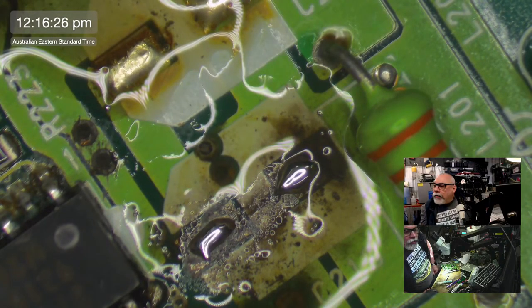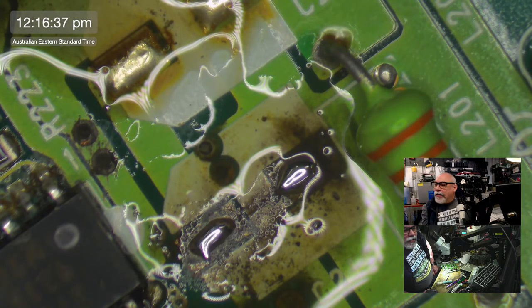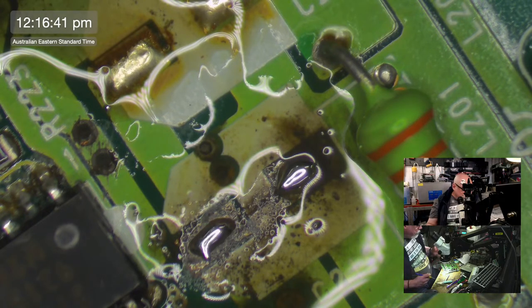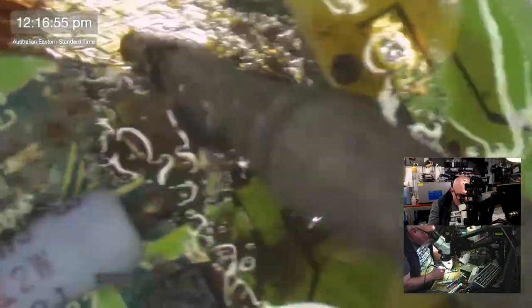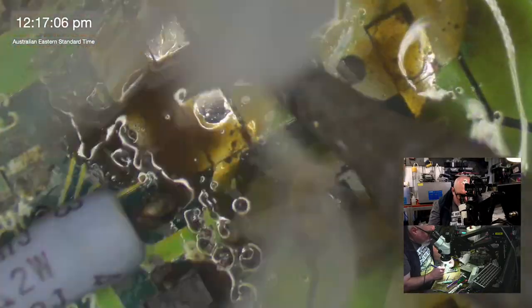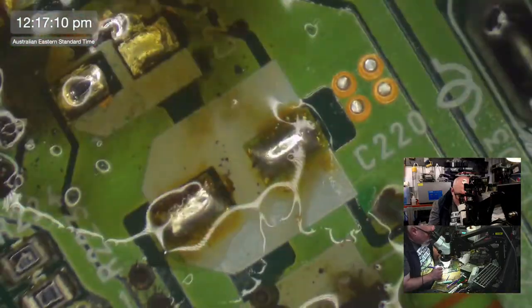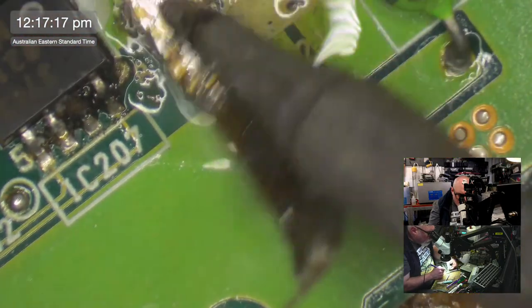Weird LCD prototypes from the early 90s with a counterbalance display and pyramids in dark blue. Does anything on that board need a continuity test? Theo, I think there is an argument for that. But I've done enough of these that look like this and not had any problems. Once I clean this up, I might have a closer look at some of these vias, like here. As long as I can scrape the top off and find copper underneath, I'm usually pretty confident they're going to be continuous.